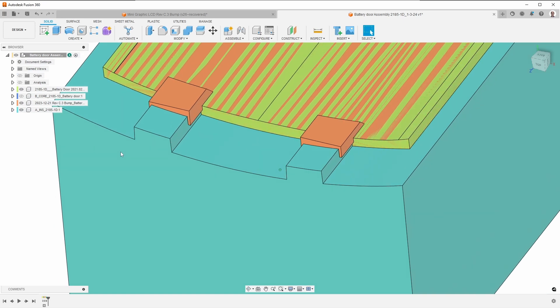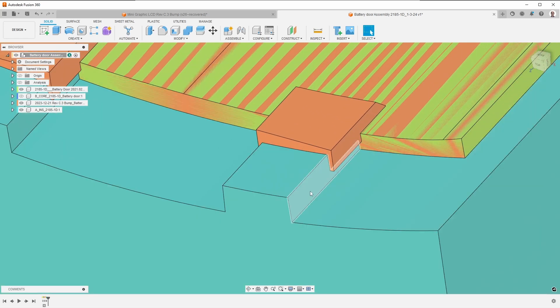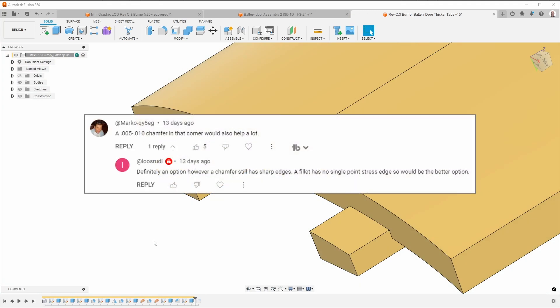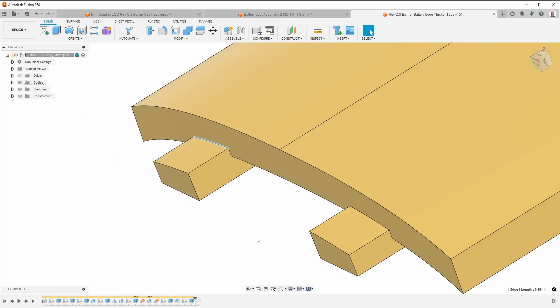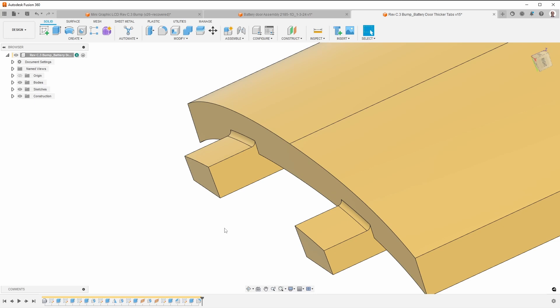That's why you would have to weld metal back in here and then remill it. After some discussions with TCS and Texlon, we made the decision to go back to the original width but just make them deeper. That was about one third of the cost compared to welding metal back into place and remilling. Something else that at least one viewer suggested is adding a fillet at these two locations, because these are stress points and a fillet will make them a little bit stronger. I did adjust that — I didn't add much of a fillet because I didn't want to change the geometry of the mating part of the battery door, but this small fillet should be enough to increase strength without creating any interference issues.